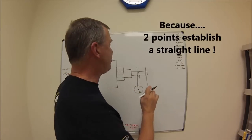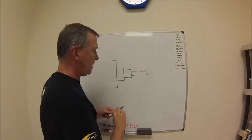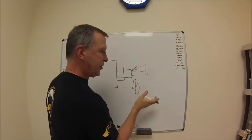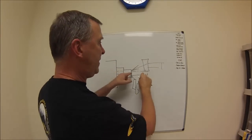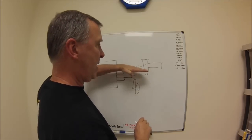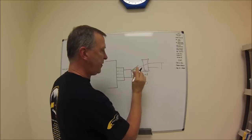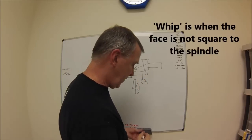Although your indicator says zero, don't trust it. The way that I like to do it — and the way you'll find me doing it more often than not — is I'll take my indicator, position it somewhat sideways, stick the body out here, and put my needle against this face, against the shoulder. I'll watch for my needle to jump around and tap it out here with a hammer, gently of course, until that needle runs zero. Then this is not running concentric at that point, but it is running square to the spindle. So if you indicate the face of your part first, you bring it into a coaxial relationship with the machine, then you put your indicator on the diameter and look for zero. If you have square and you have zero, you have true. If you have zero at two different locations, you have true.